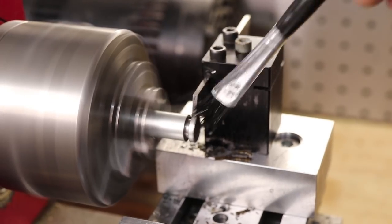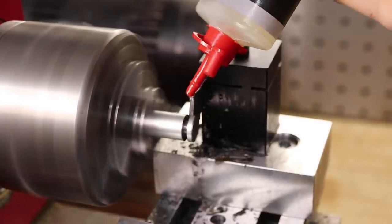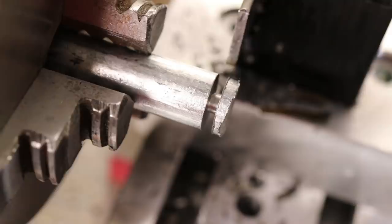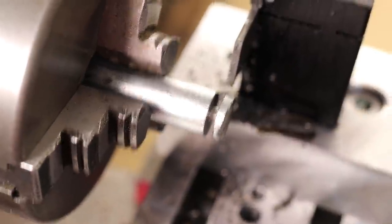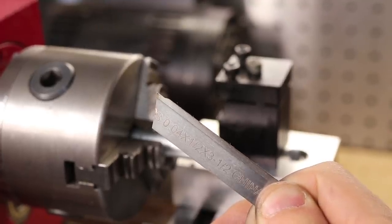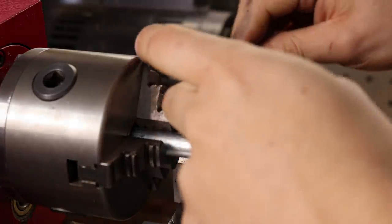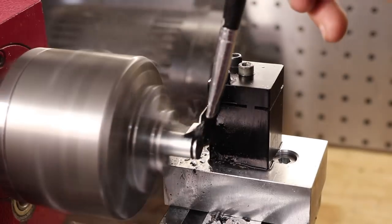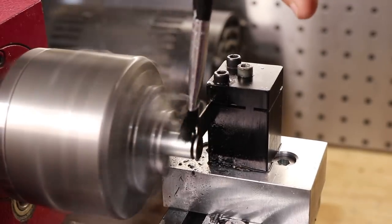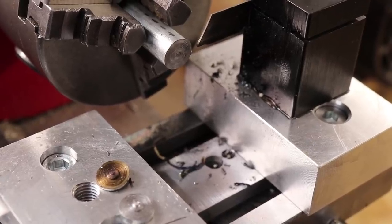Steel is typically one of the hardest materials to part and I usually do it with a hacksaw, and whilst it's cutting a lot better than before, this lathe is still struggling a bit. I'm running the lathe as slow as I can and I think it's still too fast for the steel. To see if it would make any difference I switched the blade out for a higher rake parting blade, which I typically reserve for using on plastic. And to my surprise it worked surprisingly well, though I can still tell that the lathe is running a little bit too fast.